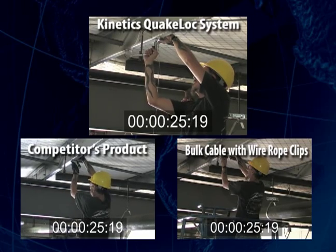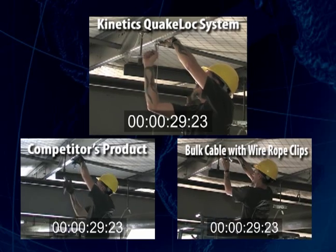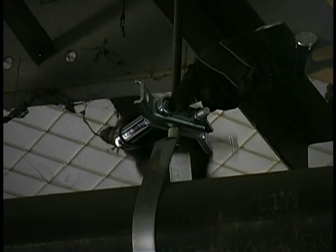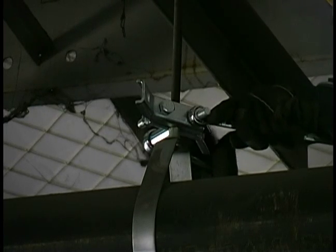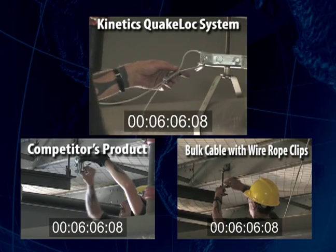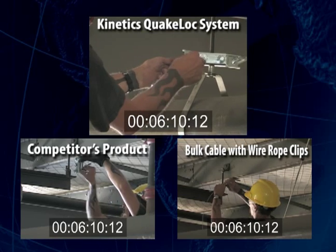Start by attaching Kinetics KSUA bracket to the structure. The next step is to attach Kinetics KSCA brackets around clevis hung pipe. Finally, run wire rope cable through Kinetics QuakeLoc connector.